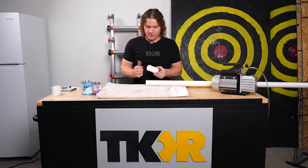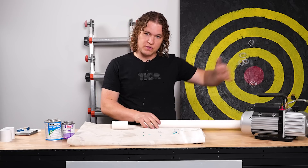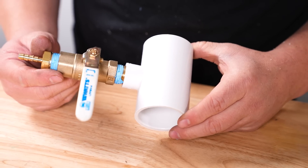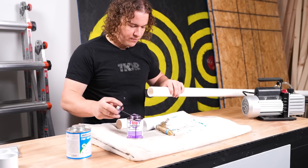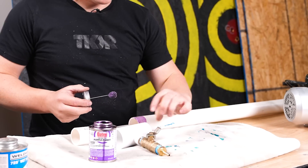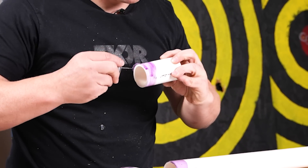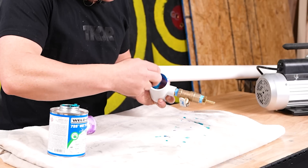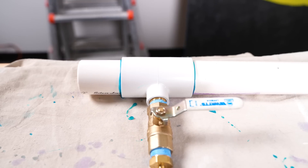The piece that I have smoothed out is going to be at the very end. Same thing with this longer piece of pipe — the one we've smoothed out is on the far end, and the sharp edges are right here because those are just going to get covered by the connection. If you want a great seal with PVC, you always want to use some primer. It's going to go on both sides of your connection, and it takes just a minute until it gets tacky — you don't want it completely dry and you don't want it wet. Now that our primer is just tacky and there are no drips, we're going to go ahead and glue our connections. You're going to twist it a quarter to a half of a turn and just hold it on there for a minute.